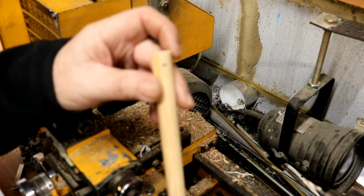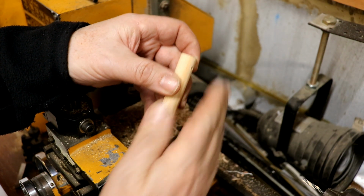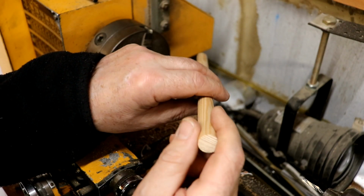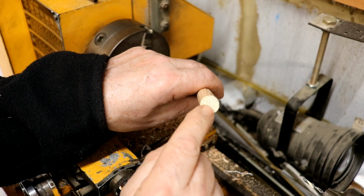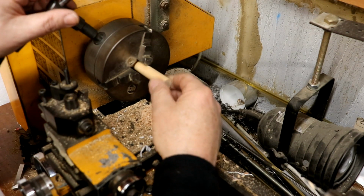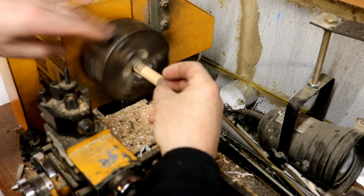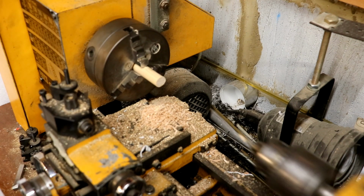Now for doweling. I'll cut it to the right length. Drilled a little hole in the top for a short screw that's going to act on the keyhole fixings. Now to put a pilot hole in the bottom. Pilot holes are brilliant, especially with kids, because if you just assume someone can screw a screw up into the middle of some beech dowel, it's going to cause all sorts of issues and be really tricky and fiddly. It would be the easier option, but obviously easy doesn't come into it. I'm not going to tighten it too tight because I don't want to crush the different bits of grain.